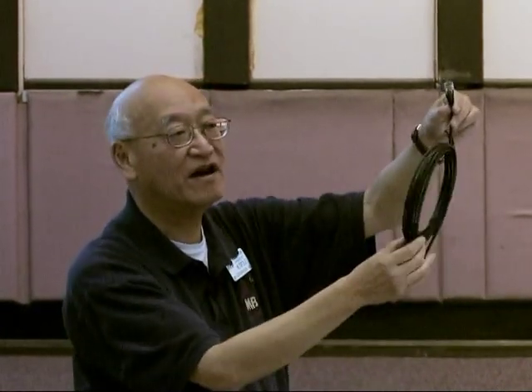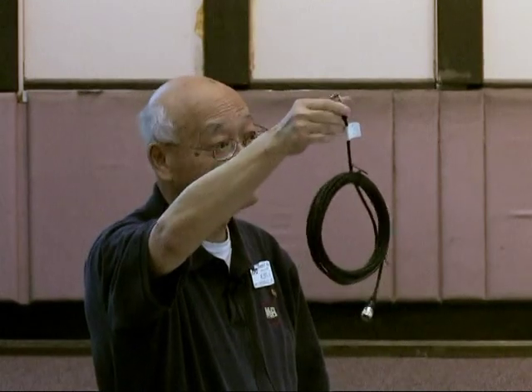Let's say you've got one and you don't know which connector it is. You can take a chance and just cut it off, because you always cut the wrong one off — you cut the good one off. Smart kid here: just put it on distance to short. If you're on the right end, it'll just tell you how long it is. If you're on the wrong end, it shows you short all the time, so you can find which end is shorted.